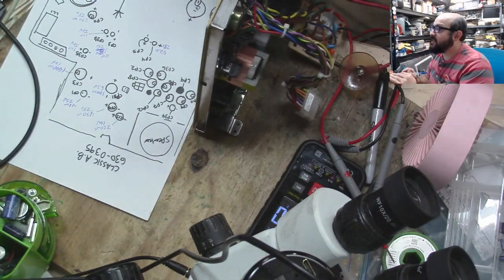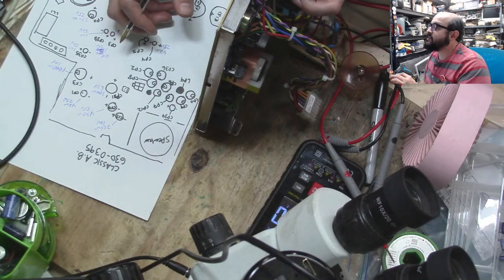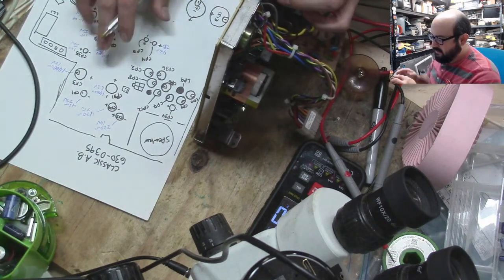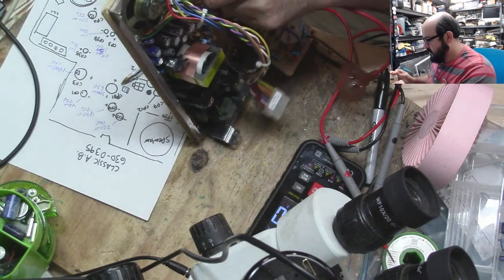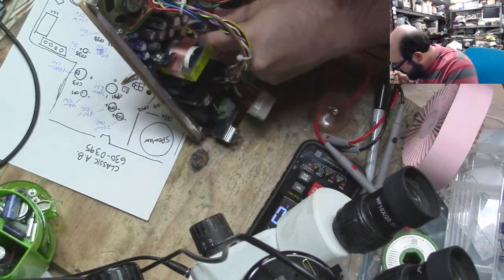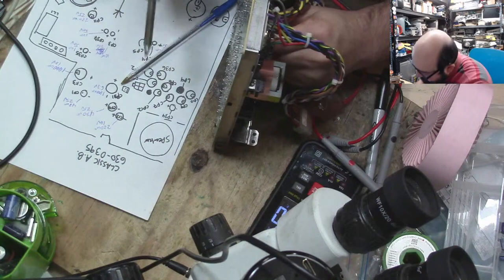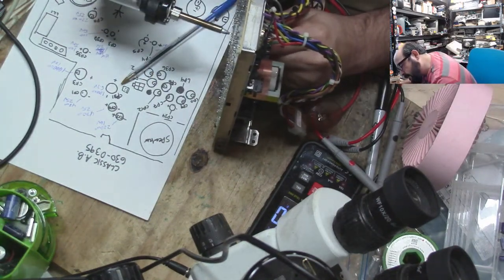4725. Speculate why a Power Mac 9600 freezes on boot for the first few minutes, then it works fine after that, till the next day when it does again. Ask Tinker Different, no reply for 2 weeks. Red Leader, I can't exactly determine that by not looking at the thread. Does it do it with a different hard drive? Does it do it with a different battery? Does it do it while wearing socks? Does it do it while eating lox? I mean, these are all questions that you have to ask yourself. Is the power supply spitting out good voltage? How do the caps look? Those are the things I would ask.